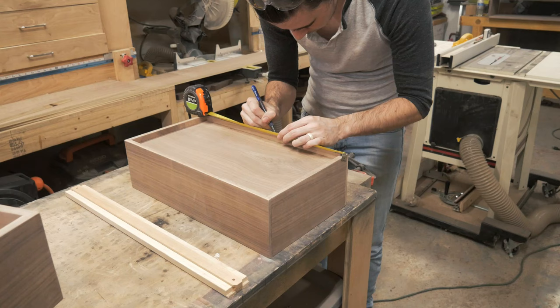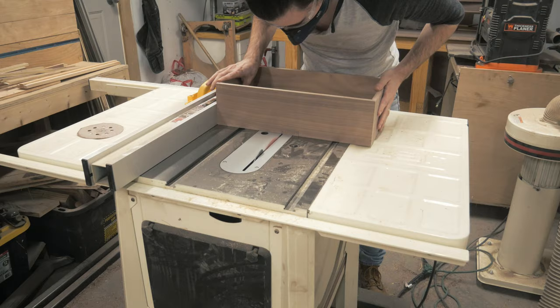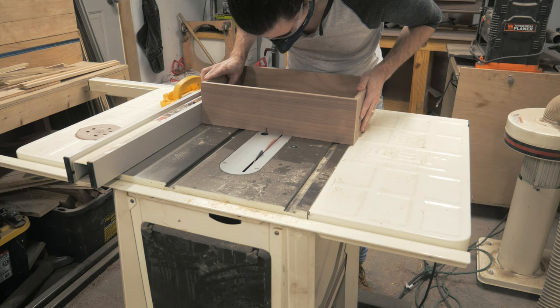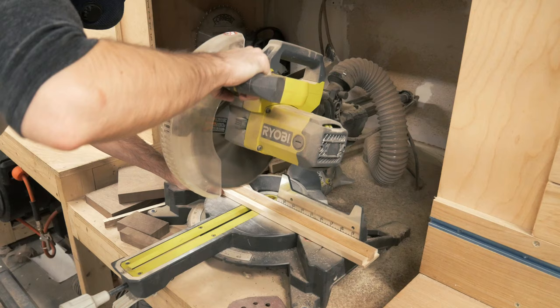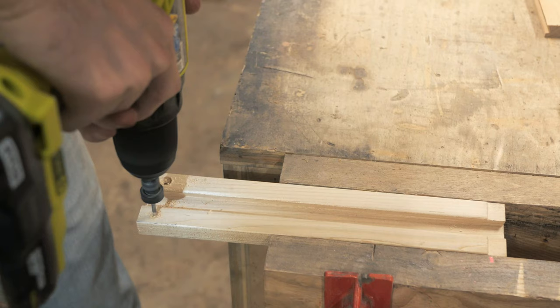The next day I start marking out the drawer slides. The table is pretty narrow and I was limited with under-mount options, so I decided to try these wooden dovetail slides from Rockler. Using the table saw, I cut out each side of the groove, then took multiple passes to remove the middle. This was a little time consuming and next time I'll probably just use a router to remove most of the waste. Next, I cut the slides to length with the miter saw. Since I cut them down, I needed to drill a few mounting holes into one of the slides.